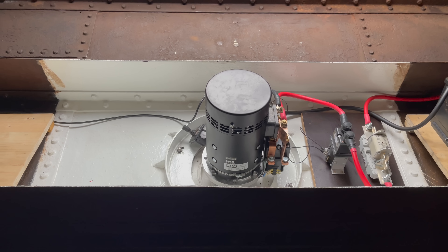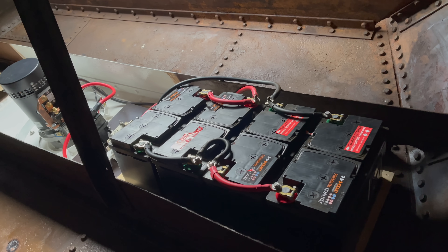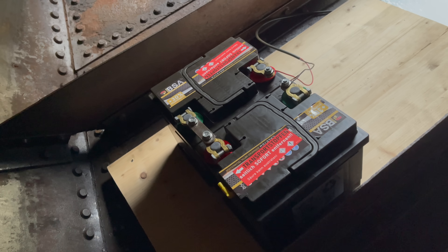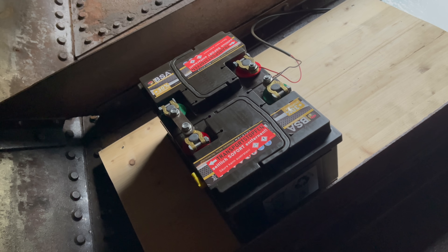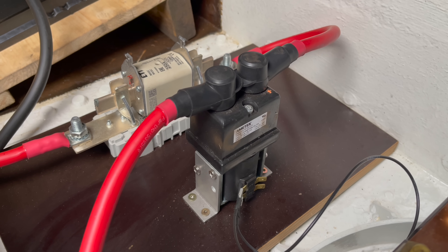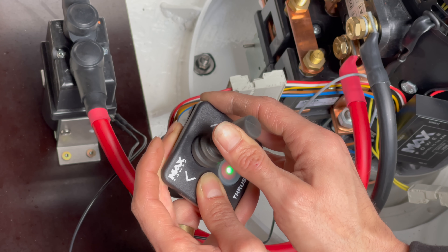Now on the inside, here's what I did to get it to run. I doubled up the capacity of the main battery bank — this might still be too little, but at least like this I can run it properly. For the required second battery bank I also increased the capacity, and this time used a 24-volt battery bank. Because that's why it wouldn't run before — the control board also needs a 24-volt power supply in order to trigger the battery isolator and the relays, which made the clicking noises we heard. But without a 24-volt power supply the motor wouldn't run.